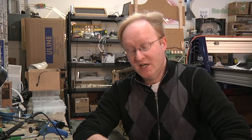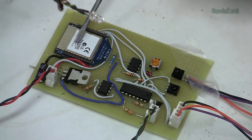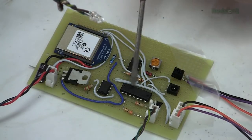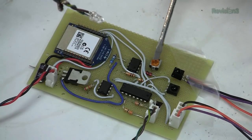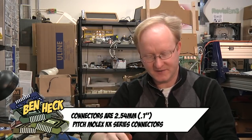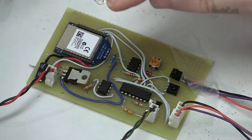I've figured out the best way to make the transmitter and the receiver, so I'm going to go over the parts on each. Here are the parts on the mailbox emitter: a 3.3 volt regulator, the XBee wireless communicator, a 555 timer generating a 38 kilohertz pulse signal for the infrared so it matches the sensors, a NOT gate because several signals need to be inverted for best logic, and an op amp used as a battery level detector. Once the battery gets low enough, it'll trigger a signal to tell the receiver unit the mailbox is low on batteries. There's also a potentiometer to adjust the op amp, and hookups for the external lights for the emitter and detector in four directions.